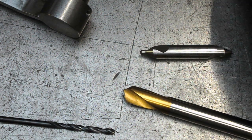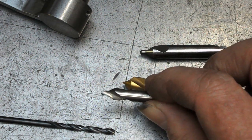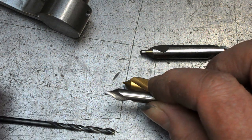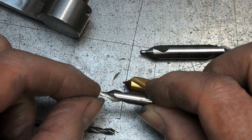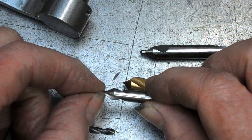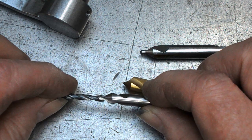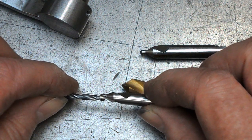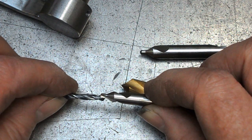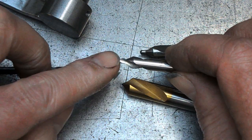The only thing I would say is that drilling it with a smaller one, wasn't that one, was it? It was this one that I also tried. That really wasn't nice at all. Going through with the drill after having that diameter pilot was just not nice. You're not taking enough metal out. The drill kind of digs in, chatters a bit. But for HSS, yeah, that is not a good option.